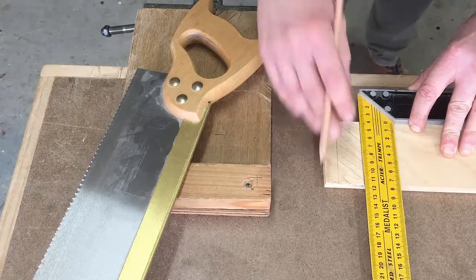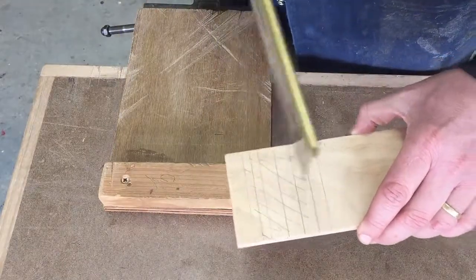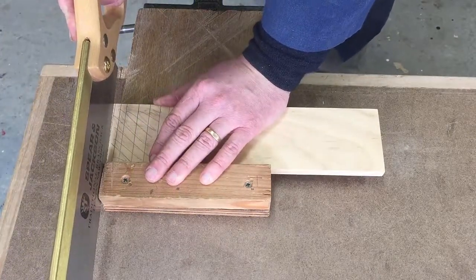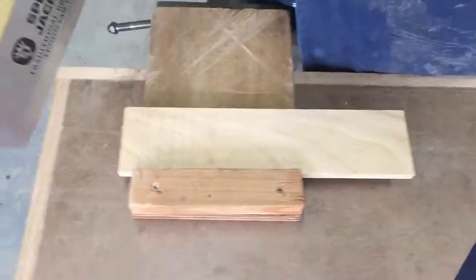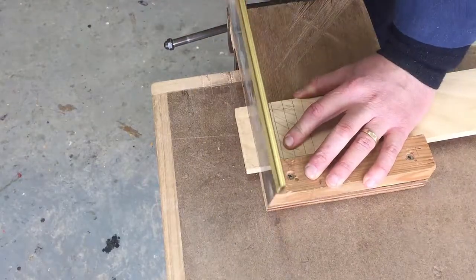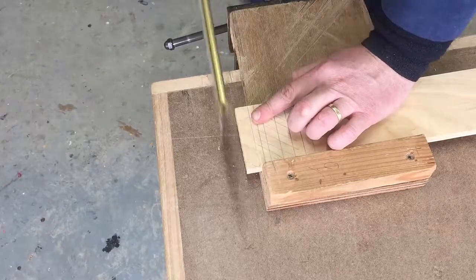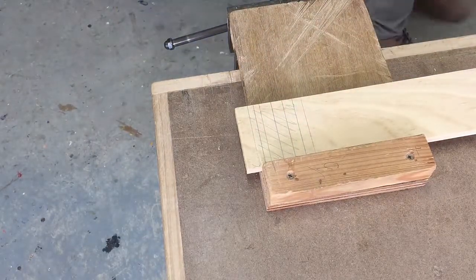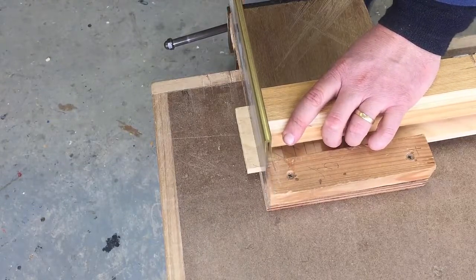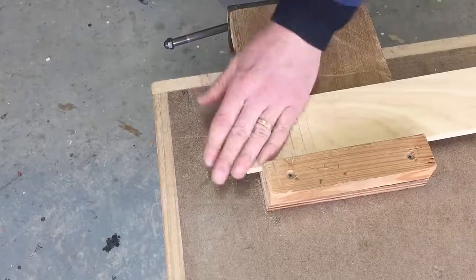We need to be precise because if you cut too far, it's hard to fix. What I'm doing here is just squaring off some lines — these are all the lines I'll cut. I'll make a little mark on these outsides but not much. Using my bench hook to get a nice line, I'm pulling back — that'll give me a groove. I don't want much of a line, so don't go down too far. I'm just using my finger to guide it, but if you want a piece of scrap to hold it, just ask me.